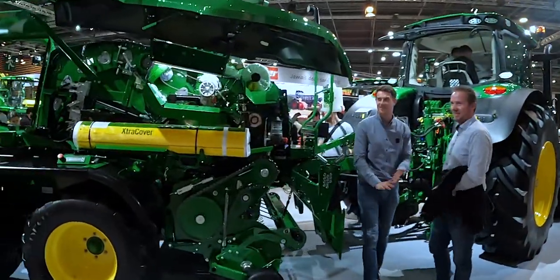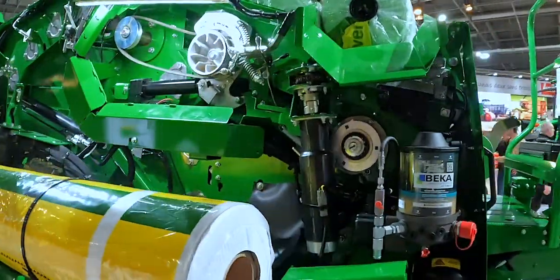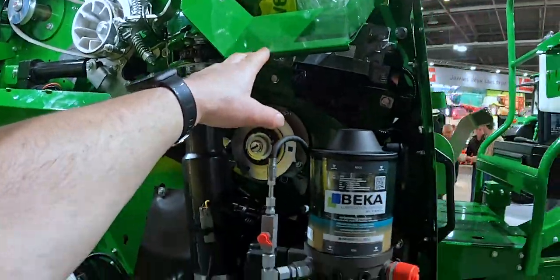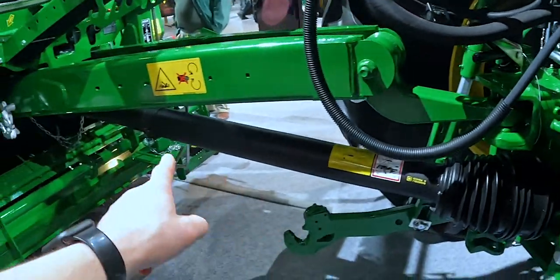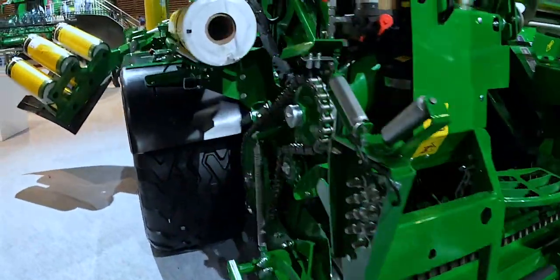So this is the combi baler. The beauty of this baler is that a lot of the balers are quite high up, so you can load everything from the floor on this baler. This has been running continental style, so high hitch point, PTO running underneath, unobstructed, no obstacles in between the two.